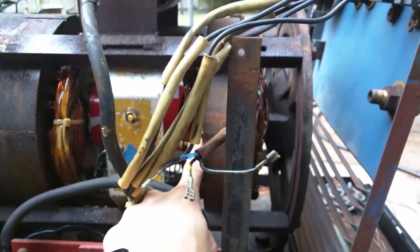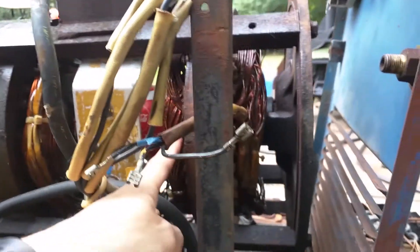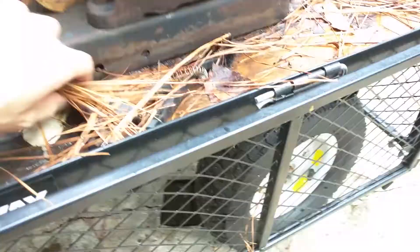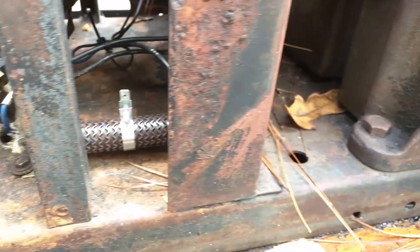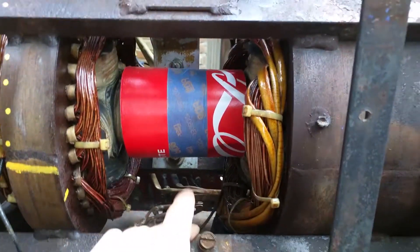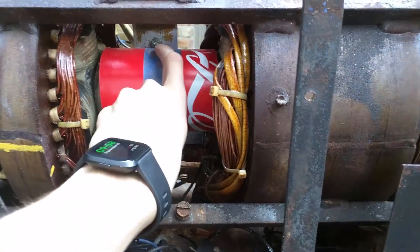The diodes then go to this plate, which fires off the main coil — which is your actual power generation and welding coil. This is a 115-volt DC coil that has to be excited by 12 volts DC in order to start. Double-throw switch, spare parts from the last time I worked on it a few months ago. The resistor in there, the old-school rectifier plate, and the brush assembly — since I was clear coating these windings trying to do what's left of it, I covered it up.